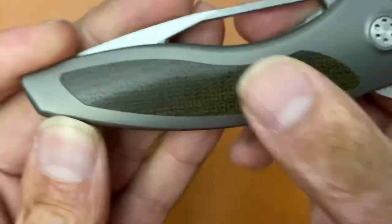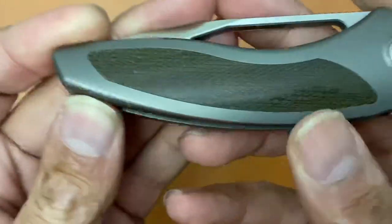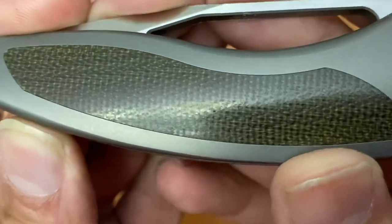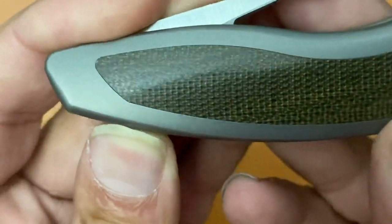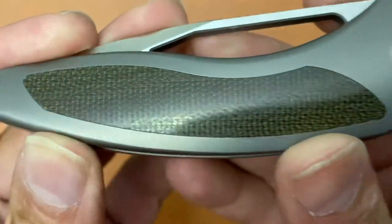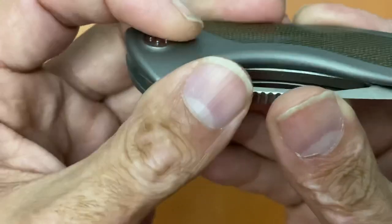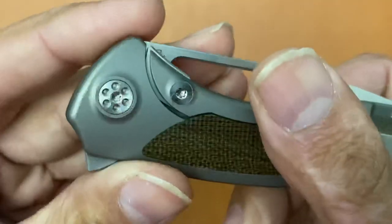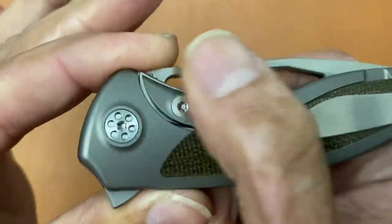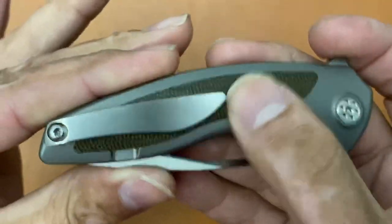Let's take a look at that carbon fiber. I don't feel any transitions — if I close my eyes, I don't feel any high spots. No crazy gaps. Micarta is a hard material to machine. From the camera, you might see a little chip right there, but I'm not stressing. What I see looks good. He's got that Brian Nadeau signature dimpled pivot, where it kind of comes up right here and you've got the holes. On this side, you have Torx fastener T8 throughout. Like how he went with a panhead here, flat, and a panhead here.